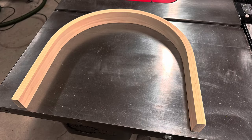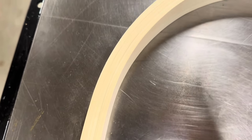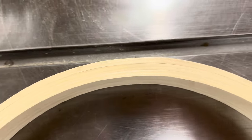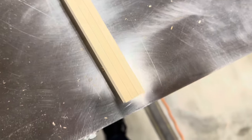When the glue had dried, I took it all out of the jig and cleaned it up on the jointer and table saw, and this time I had a successful lamination with no gaps. The glue lines are pretty evident because the Titebond 3 is a lot darker than the poplar this test was made from, but the real thing is going to be made out of walnut, so that won't be an issue.